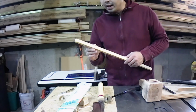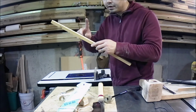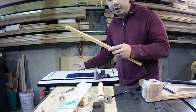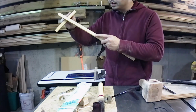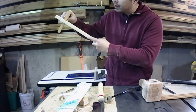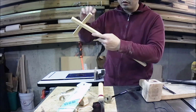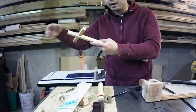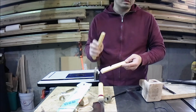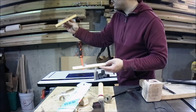But keep in mind that the width of this thing versus the bit has to be smaller than this, or the exact same size. Otherwise, if your bit is a little bit bigger in any way, this thing will be wobbling, because you have made this slot too big. See how mine is very, very tight? Because I cut it right on the inside line, not the outside line. So if your bit is too big, you'll have that problem. So what I would do is get a smaller bit. If you're working with something like these, which I think is 1/2 inch.